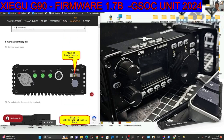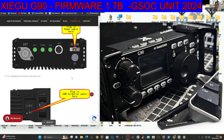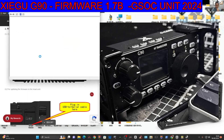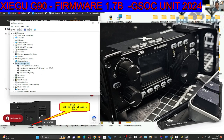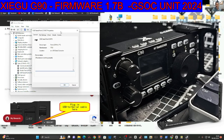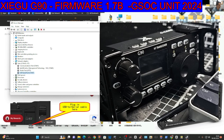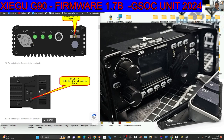I'm doing the firmware on the unit at the back. Plug in the COM cable where it says COM — that's the firmware cable — and plug it into your computer. Right-click Device Manager, look at your COM lead, double-click it, then right-click and go to Properties. Go to Ports, right-click the USB port, then Properties, then Port Settings, and make sure it's set to 115200. That's your COM lead ready. You usually get the firmware cable in the box; if not, you can buy one for about ten pounds.